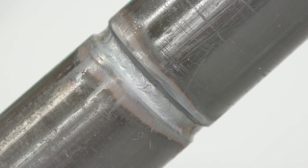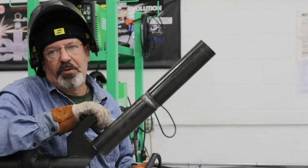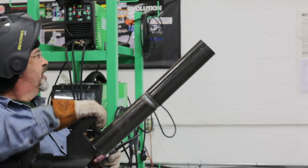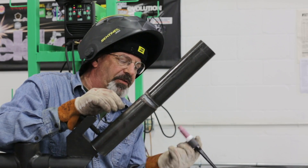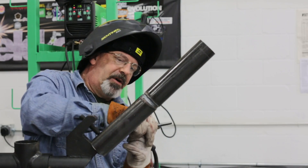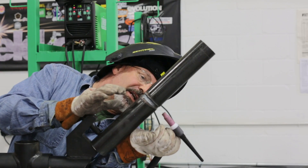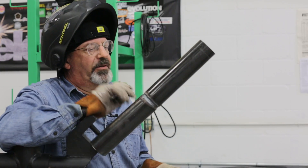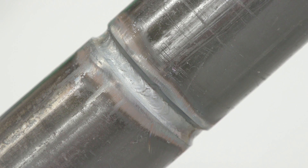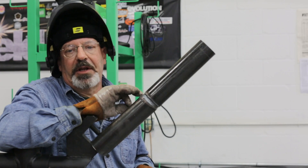So this concludes our Root Pass Run 6G 2-inch Schedule 80. I ran off an Everlast 161STH at 115 amps with my fit. I ended up wrapping the cable around my arm and holding it where I was resting the heel of my hand so I could get the right angle and the wire. It's hard to film these small bore pipes. This is the root, and we're going to continue on and do other episodes — we'll do the fill and the cap.